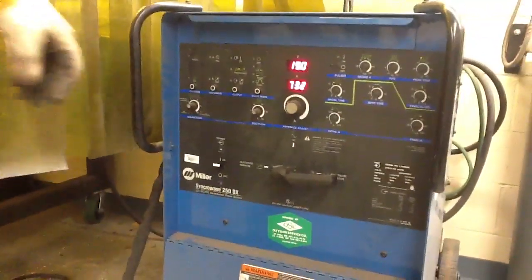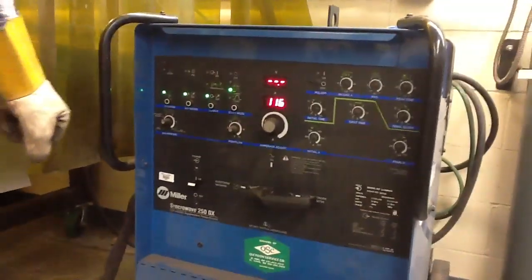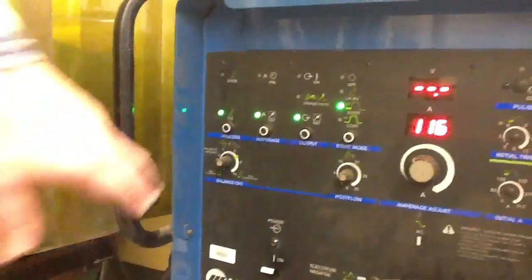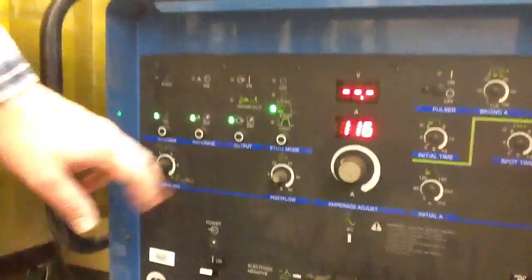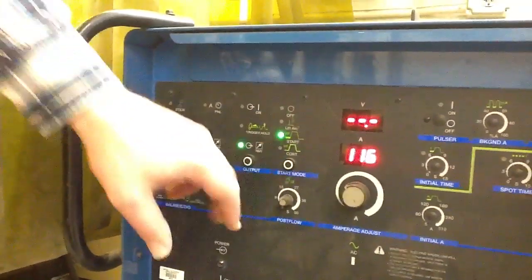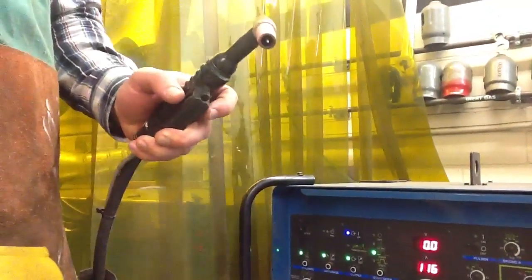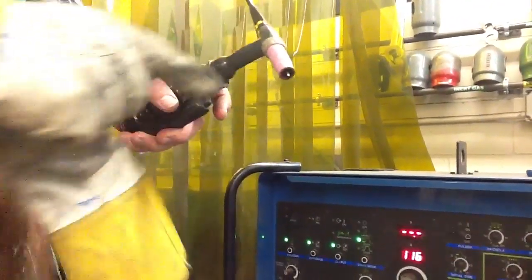Next thing is to turn this machine on. It's going to calibrate itself, come up with a couple numbers, and then reset and ask you what you want to do. Right now the process is set to TIG. I can toggle back and forth to stick, which is arc welding, or TIG — I want to make sure I'm on TIG. My amperage is remote, which means I'm going to control it with the dial. My output is remote and my start is high frequency. The high frequency start simply means that when it starts up, it's going to run some high frequency electricity — you can actually hear the gas flow already, and that's the high frequency buzz. It's trying to find its ground, so I'm going to shut the dial off.